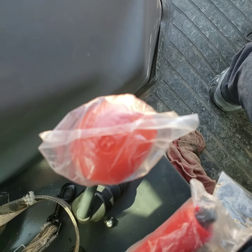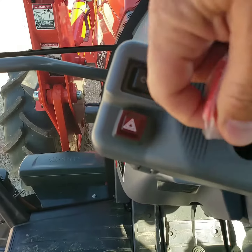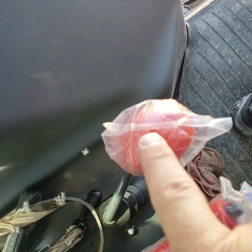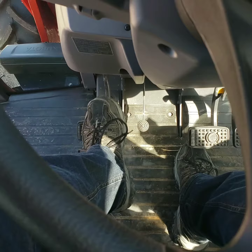This is your manual high-low lever right here. Here's your forward reverse shuttle right there — no clutch needed for that. You must clutch and come to a complete stop to shift this high-low. Here's your clutch pedal right here.